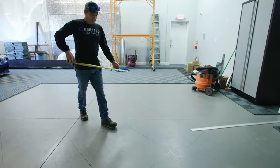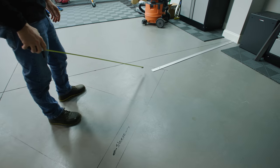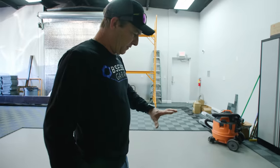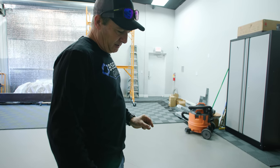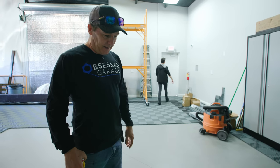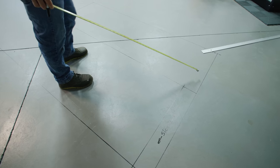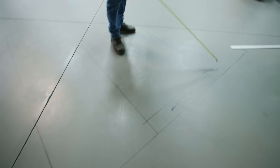We tightened this up a little bit. I think I'd mentioned that earlier. So Nussbaum says 28 inches. We're gonna tile the inside. So finished out, it'll be right around 26.5, which will give us just over a half an inch of clearance on either side. Normally it's like an inch and a quarter. We kept the overall length the same because it has to be for the collapsible ramps to fit down in there. And then this is sleeving from this side to this side for the hydraulic lines to go through.